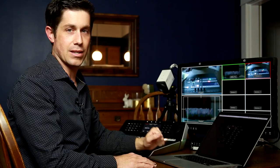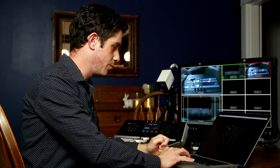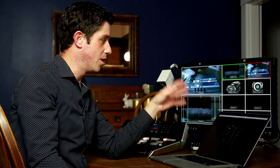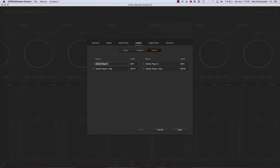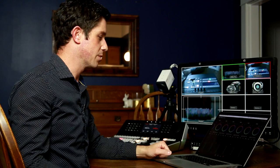You can also assign media players to the multi-view boxes — for example, number 3 as media player 1 and number 4 as media player 2. So now I can see all four sources I have available right on screen at the top, exactly where I want them. The OSD is very nice because it puts the name on screen so you can be confident that what you're selecting is what you want. Under Labels is where I created those custom names, and in the media tab I can rename media players too — for example, calling it 'BMD Micro.' Once saved, it immediately updates on screen.